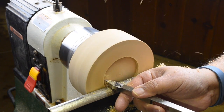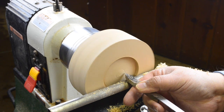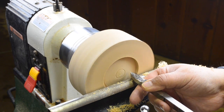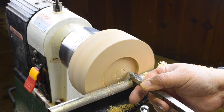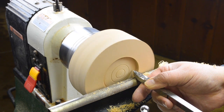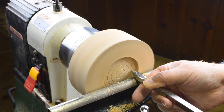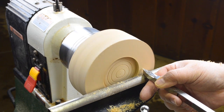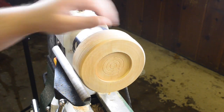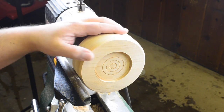I'm going to blend that and then add some little details — we could totally do this with a parting tool but we're just going to do it with the detailer. I'll add another one here and there just because I can. As will happen with turnings, I had to do a slight design modification — ended up having to flatten this face and redo the recess portion, which gave me an opportunity to come in and round this over. This time I'm going to attempt to do it with my spindle gouge to give us a little bit of control as I just ever so carefully round this bottom edge.